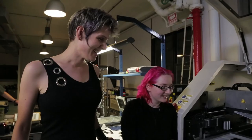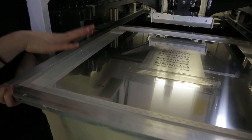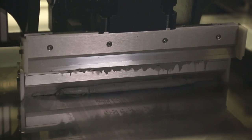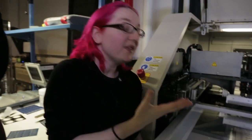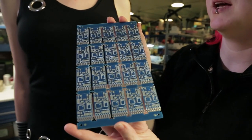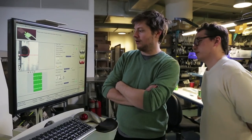So now we're going to go to the stenciler. These are huge stencils with aluminum frames, and inside is laser-cut stainless steel. All these little holes are cut out of the stencil with a precision laser cutter. It's pressed onto the PCB and then squeegees a thin layer of solder paste, which is like liquid solder — not delicious peanut butter. Then it does a visual inspection to make sure it did a good job. On the bottom of the stencil are laser-etched fiducials that match up with the PCB fiducials. It's quite nice, and that goes straight into the pick and place.